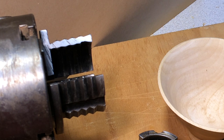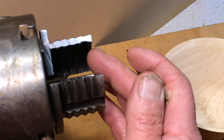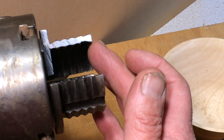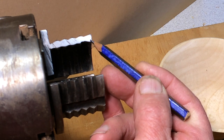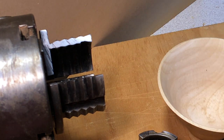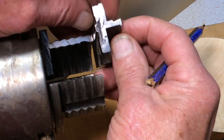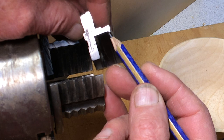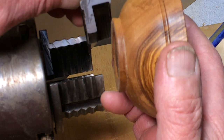What enables me to do this is the shape of the jaw. This is a dovetail that has just been slightly rounded over so it's safe — not sharp. Whereas so many jaws have a little chamfer on the inside, which I don't think are worth buying, or even worse they have a little square section on the inside, and the problem with that is it won't fit into a corner.